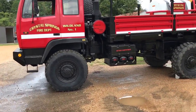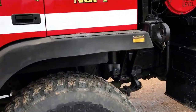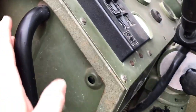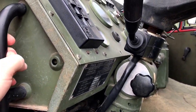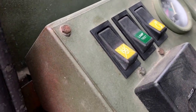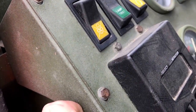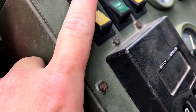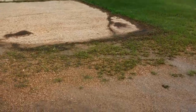One thing I forgot to show you inside the truck: if you're going to be riding in deep water, you want to make sure the radiator fan is off. The water you're riding in will cool the motor. To turn the radiator fan off, there's this switch right here — just flip it down. That turns the fan off so you don't burn up the motor. Remember: deep water, turn the radiator fan off.